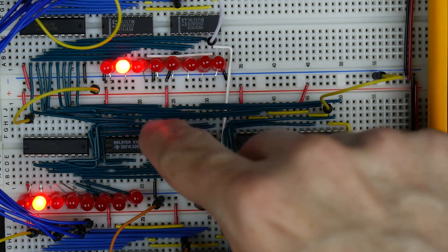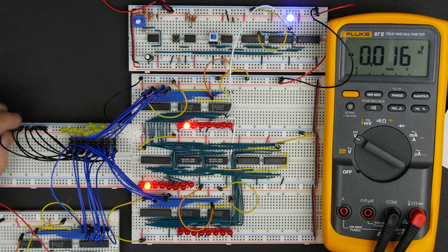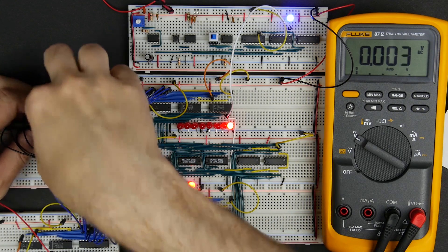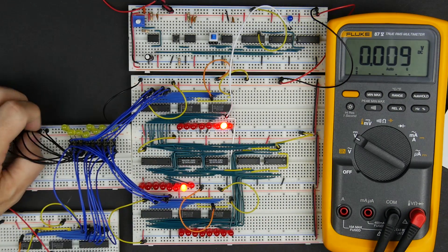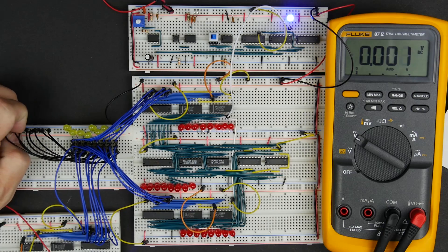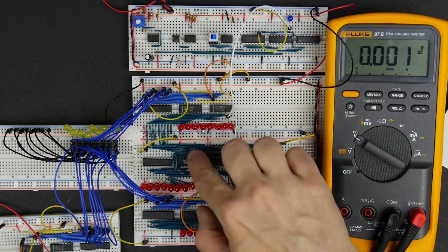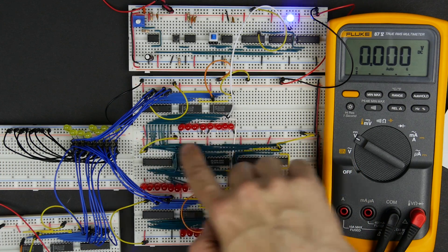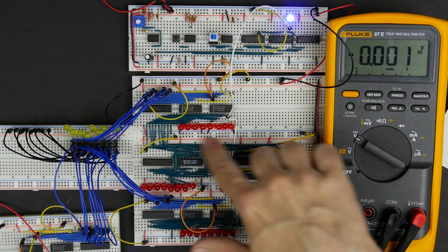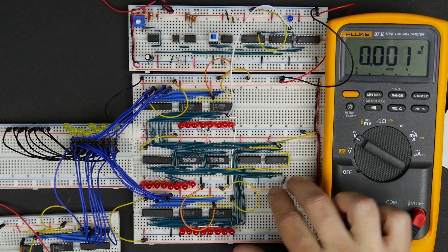So hopefully that's one problem fixed. I suspect it is not the only problem though. I'm going to re-test all this stuff to make sure we didn't mess anything up — first bit, second bit, third bit, fourth bit, fifth bit, sixth bit, seventh bit which we just fixed, and the eighth bit. Okay, so we found and fixed one problem with our A register connecting to the adders. I suspect there's still another problem with the B register, because when we started out the A register was zero, so we wouldn't have encountered this particular problem.